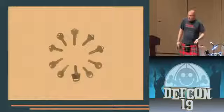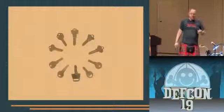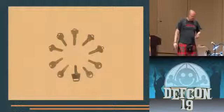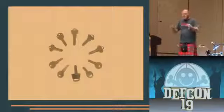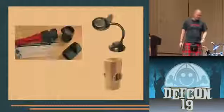Brass keys seem to be the best because they make nice markings. On a steel key, some are made of steel, you don't get markings. And if you switch to aluminum or any other lighter materials, they tend to break. So the middle of the road type, brass, seems to work out the best.